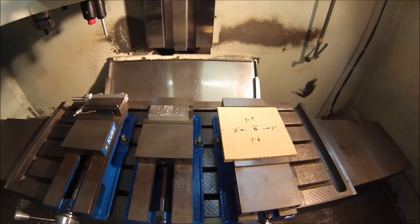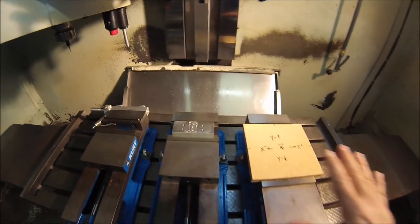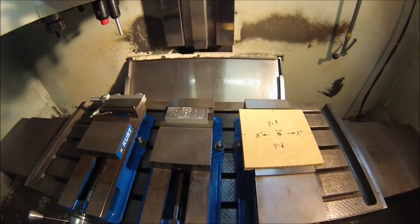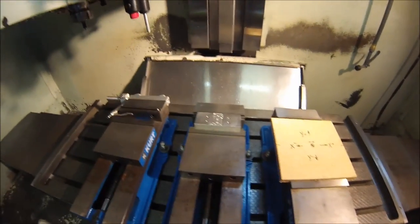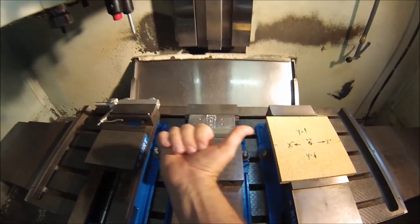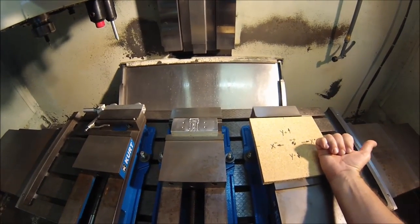Although the cutter stays stationary vertically, it does not move. The table does the moving. Sometimes a positive and negative move can be somewhat confusing, but just imagine that it is the cutter that's moving. Anytime the cutter ends up on this end of the table or moves in this direction, it's a positive move.